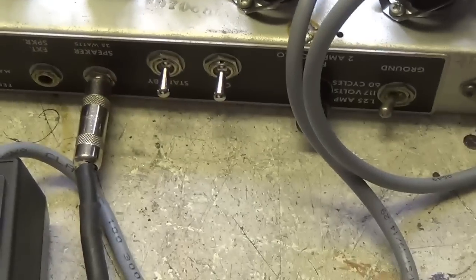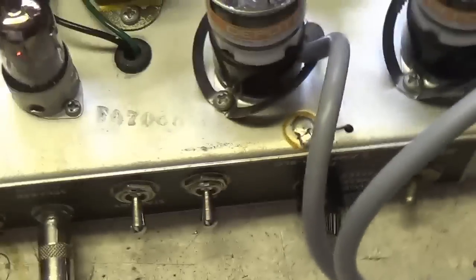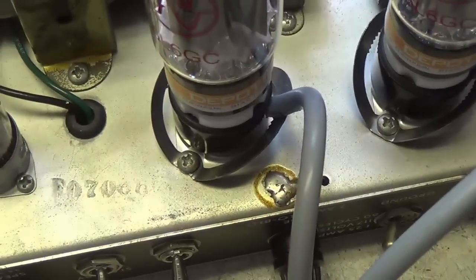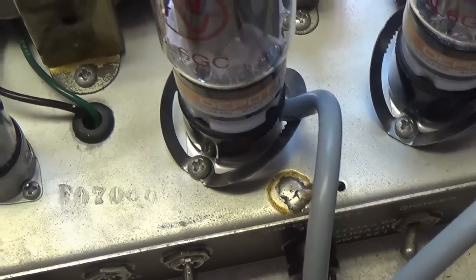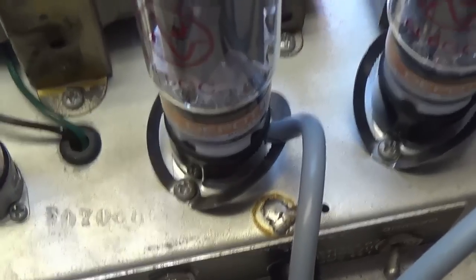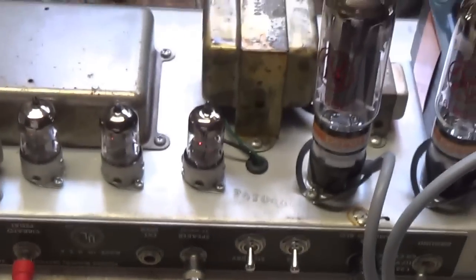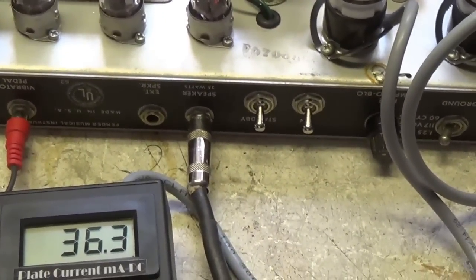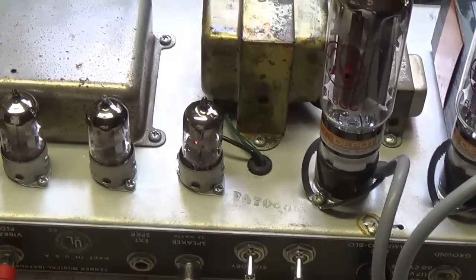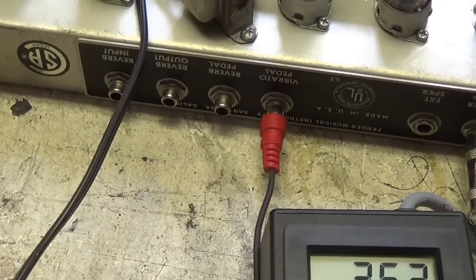Well, it's kind of shallow, and I'll be honest with you, the first time I turned it on, it took forever to come on. What he's saying is true. I think there's an issue in the tremolo circuit that we'll have to address. But it's very slow to initiate the oscillation. Okay, let's plug in the reverb tank and see if we can get any reverbing.